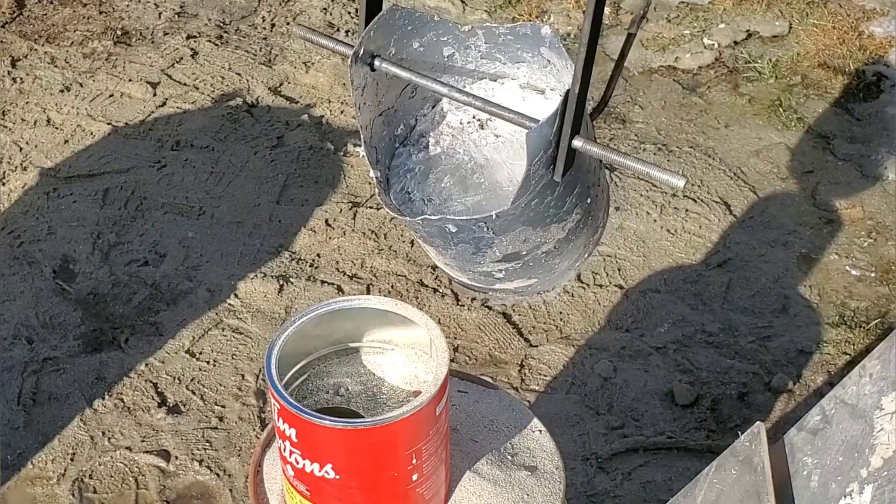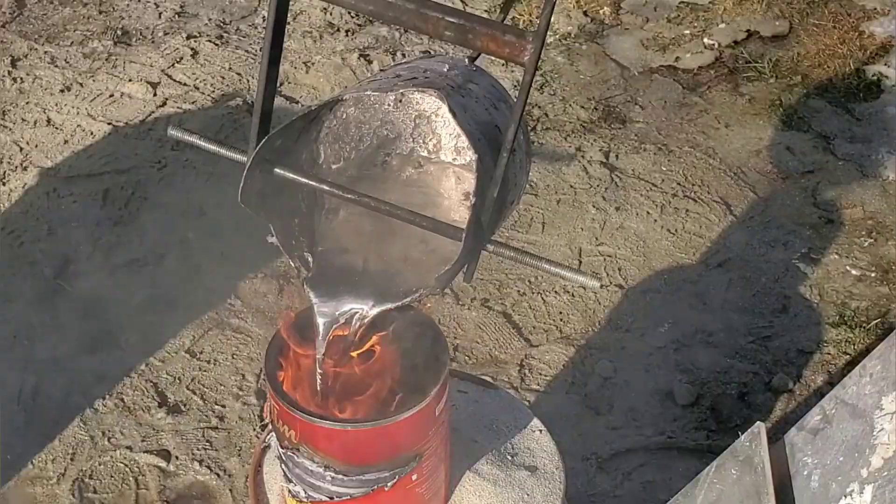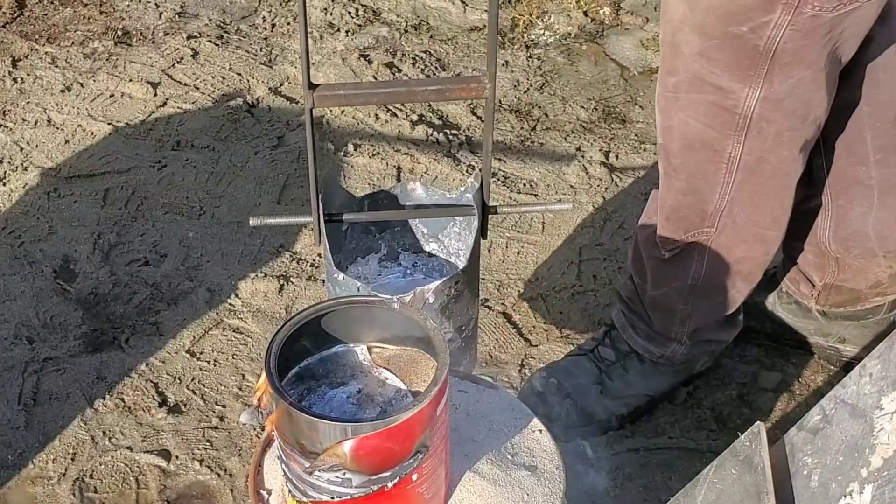Now for the critical moment. The cup has to become full and then stay full, because if the cup becomes empty at any point the sand will collapse around the part, leading to a failed casting. The remaining aluminum will be poured into ingots and reused again later.